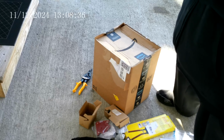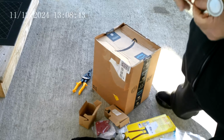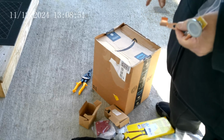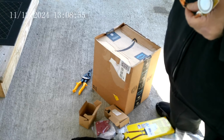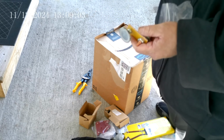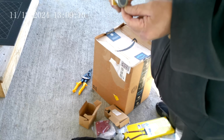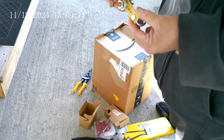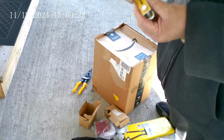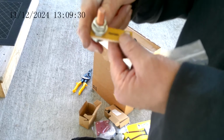And here comes another piece of mobile welding. Okay. What my ground lead is, I have another extra one anyway, but the one that's on here just has a regular clamp. Well, you get this little kit here, and what this is, you put your lug on your wire, you can crimp this on however you want to do it, and then now you have another magnet, right? You have a magnet with a fiber board. It's very, very hard. I mean, you're not going to break that. It's like steel practically. This is like what a part of your points and condenser ignition is made out of. This fiber board.